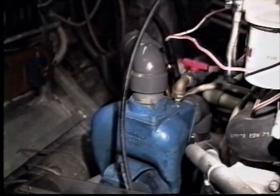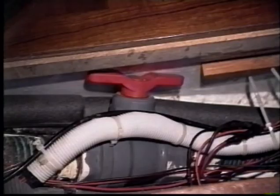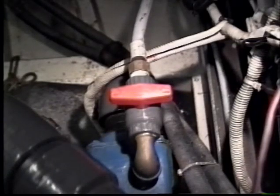That's the damage control pump. It's a 200 gallon per minute self-priming centrifugal unit made by MP Pumps. There's a suction line that runs to the forepeak and the central sump with a final leg here in the engine room. Notice the priming line from the freshwater circuit.